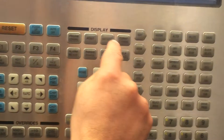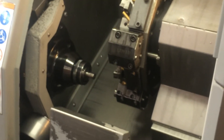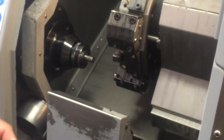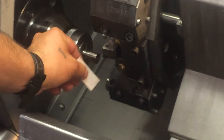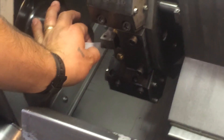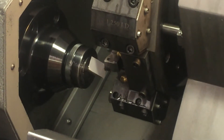Then you can go back to handle jog and grab a shim. You can use a metal shim, you can use a plastic shim — I use a piece of paper. They're inexpensive and they're very accurate. So I'm slowly going into the face of the part until I make contact with the piece of paper, until it finally stays there. I can have a little drag, but it stays there.